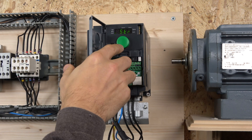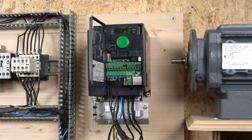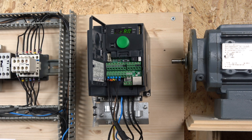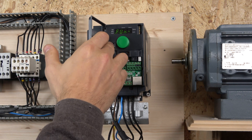The next parameter in there, called STR, lets you specify how you want the speed reference to be handled when changed. One option is RAM — which means it will save the speed in RAM. So all speed changes are saved. If it stays on 'No,' no frequency is saved, and every time you stop the drive the system goes back to zero. If you want the speed to stay where it was previously, change it to RAM.